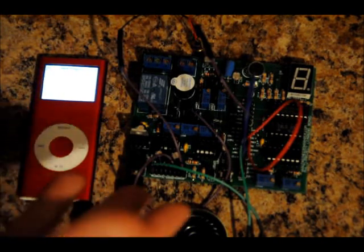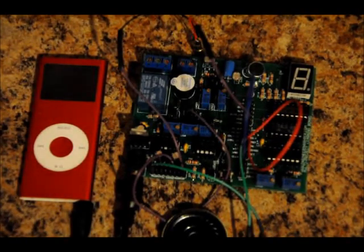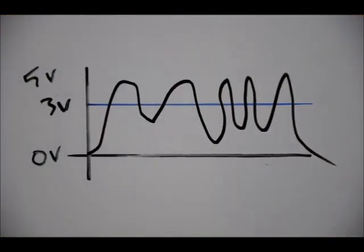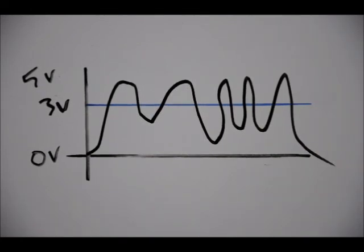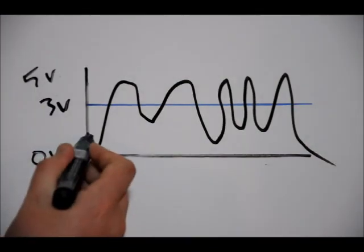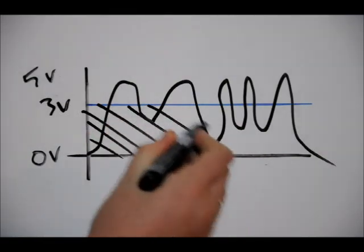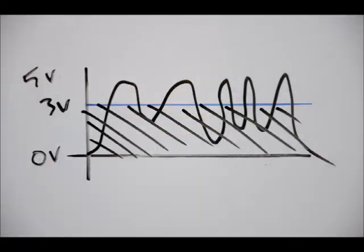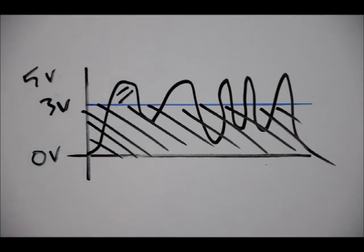The reason I did this project was because I wanted to do it on the board, but the board has its limitations relative to the circuit. Let's talk about what's wrong with it. One of the reasons why the audio signal is so poor is because the laser takes between three and five volts to operate, and our signal is between zero and five volts. So anything at an amplitude less than three volts is not going to be transferred, because the laser is only actually emitting light during the top spikes above three volts. So we're losing a ton of our audio signal, and that's what makes this circuit leave something to be desired.